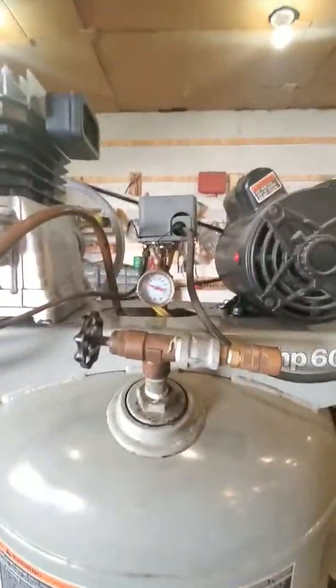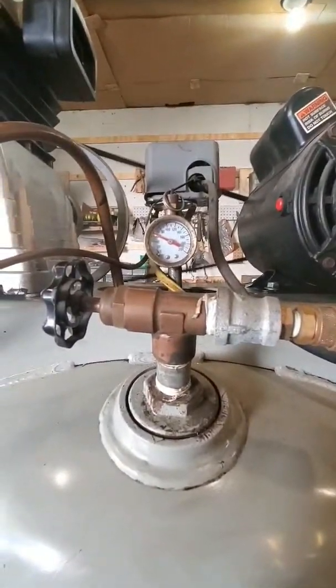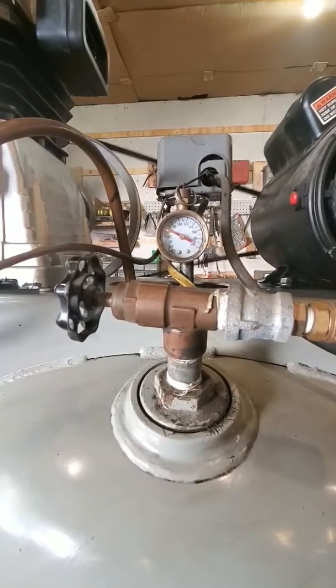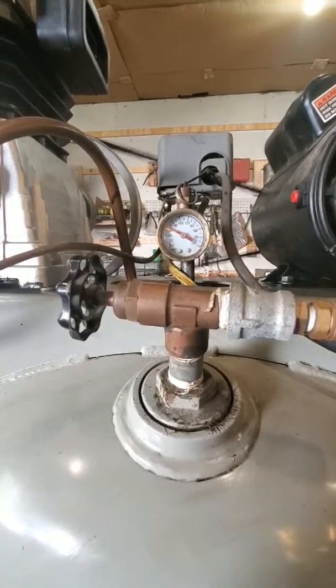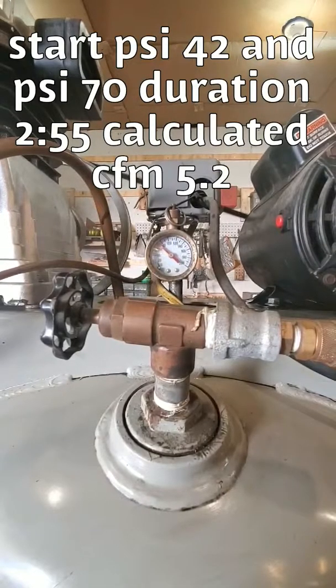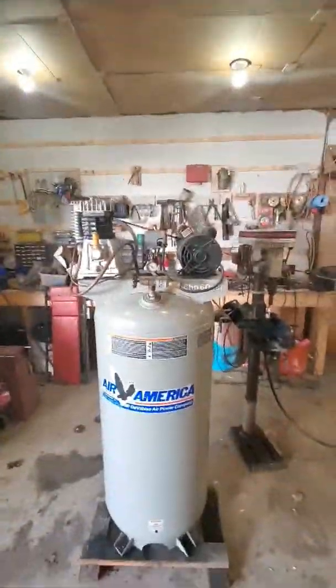When I first put it together — I was fixing an oil leak, which is why it was apart — I think I was in the 5.4 CFM range, and I was not pleased with that. Then I realized I needed to test the RPM. I'll run up the pressure and do the math later — I'll post it in the description or comments. That's 70 PSI; that'll be good enough for doing the CFM calculation.